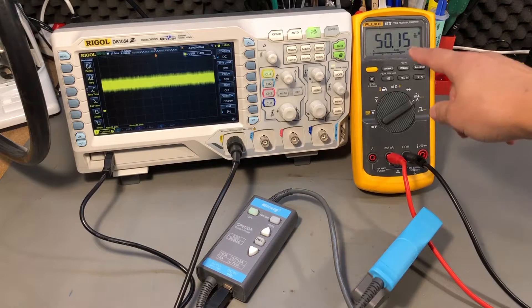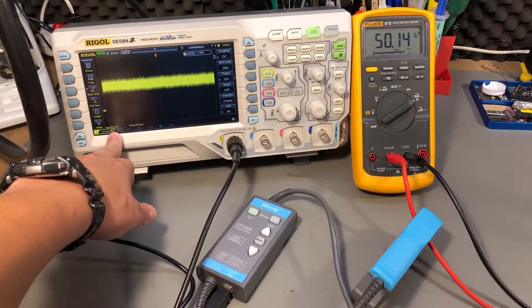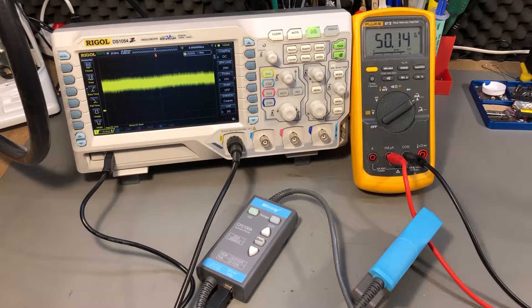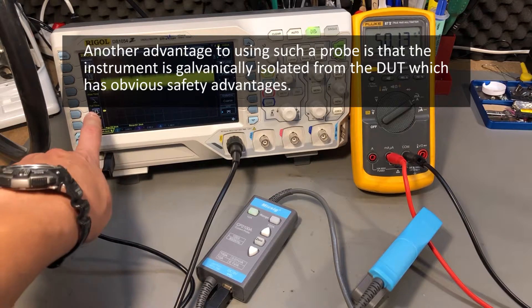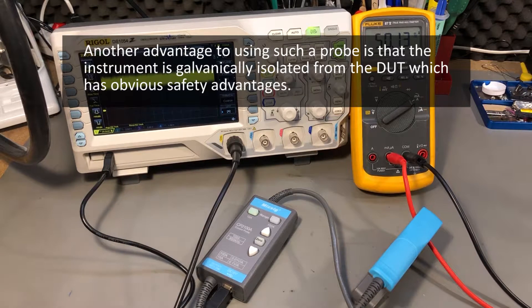It beeped and the light turned off, which means the unit is now zeroed. We can use it to measure the current I'm putting through this wire, which is 50mA from my bench power supply. We are seeing an average value of about 56–57mA measured by the probe — there is some noise involved, but the point is that this is better than the ±50mA stated in the spec sheet. To be honest, you're not going to use a current probe for this kind of precision measurement — this is more a tool to visualize current in a graph over time. When you need precision, you switch to a multimeter.